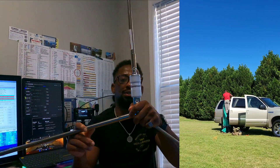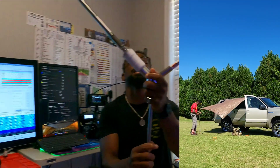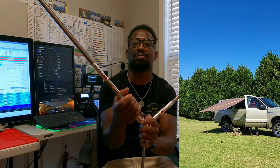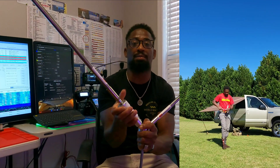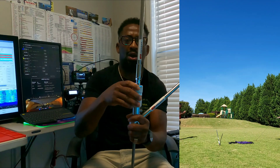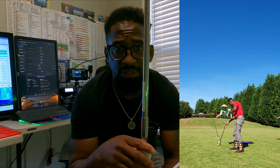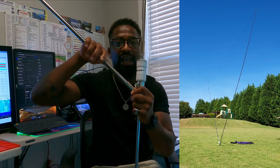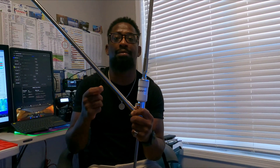But the crème de la crème of antennas I'm using with this radio is the Tactical Delta Loop by Chameleon. I love this antenna — it's the Tactical Delta Loop with two 17-foot telescoping whips, a ground spike, and a 25-foot piece across the top. I also love it because when I'm on a summit with limited real estate and I want to do some DX, I can go vertical: a 17-foot vertical whip with about a 31-foot counterpoise for resonance. I don't bring tuners when I'm out doing SOTA. The Chameleon Tactical Delta — delta loop and vertical — is my primary antenna for HF with the Doomsday Radio.